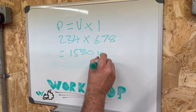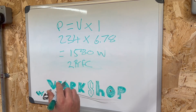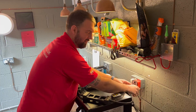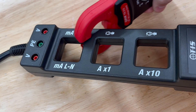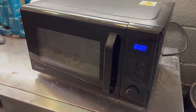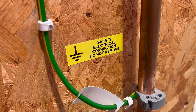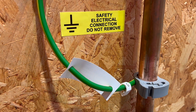Of course, I haven't factored in the power factor in my simple calculation. The rating is, however, similar to what is on the rating plate on the side. Perhaps we've identified this appliance as a rogue operator which is tripping one of our pesky RCBOs. We have two options to measure the leakage current directly on the protective conductor. However, this is not a true value, as the appliance has a metal frame and is sitting on a metal cabinet, which could give an alternative path to earth.